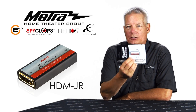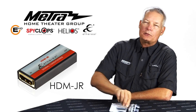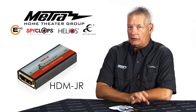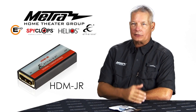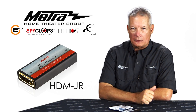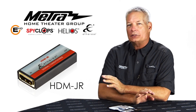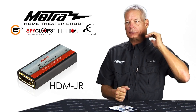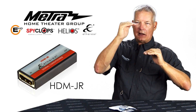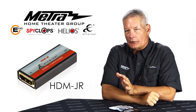The HDM Junior is specifically designed to take care of that problem. It does this by stripping capacitance off of the EDID or low speed data bus. When you look at the data bus, it's in the classic ones and zeros. All this is is a light switch, and what you're concerned with is how long it takes to transition from zero voltage to the five volt mark. It's that point in between — the rise time — that causes your problems.